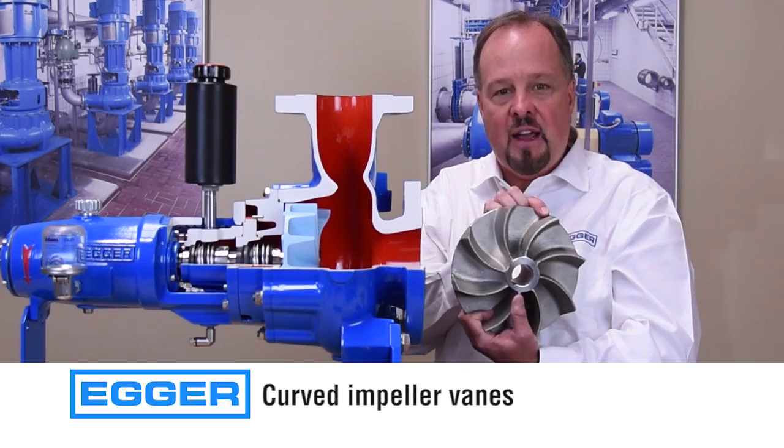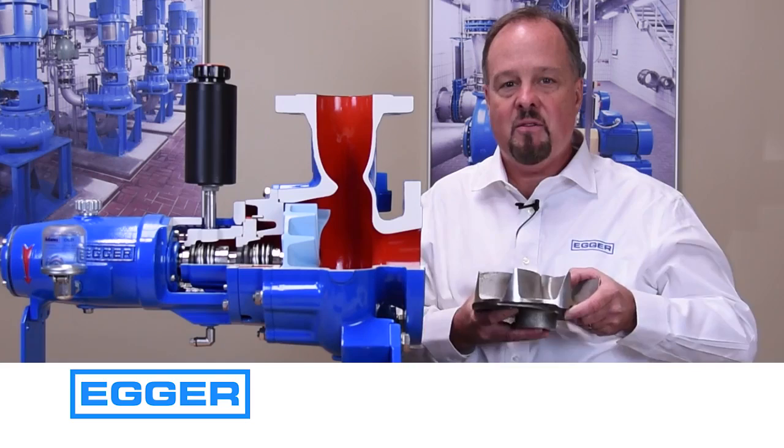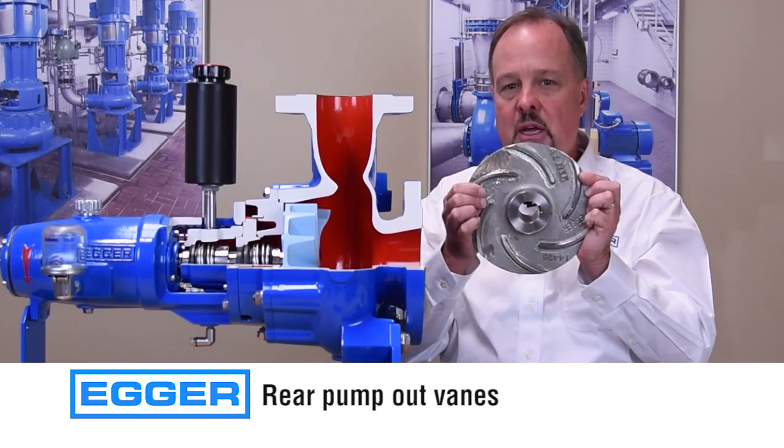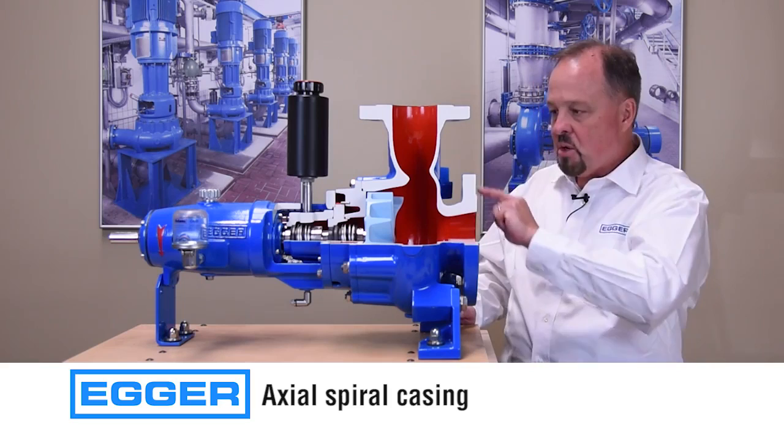curved impeller vanes, which are triangulated at the base or ramped. This ensures whatever flow enters the vanes leaves quickly to minimize contact. We include rear pump-out vanes to eliminate hair and grit accumulation in front of the mechanical seals. We have an axial spiral casing, which directs the flow toward the discharge and minimizes recirculation.